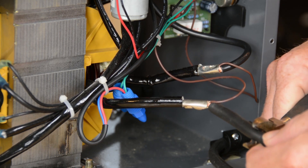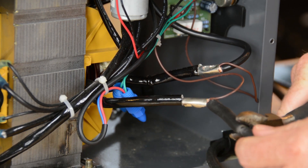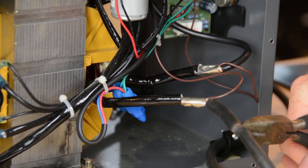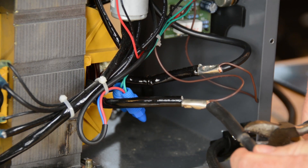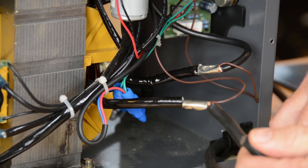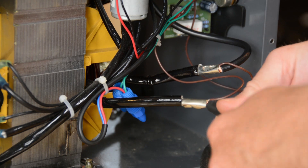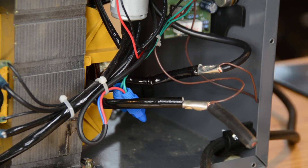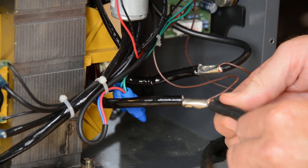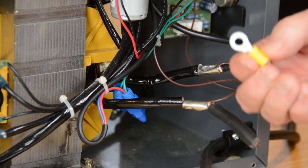Now, it is gigantic wire — it is 8-gauge wire. Probably the best I'm going to be able to do with these little small nippers is give it a crimp, so I set a line and then take a couple of stabs at it to crimp it. All right, there we go. We've done it. I'm going to go ahead and strip some insulation back from these guys and try to get these ring terminals on.